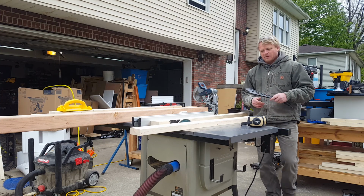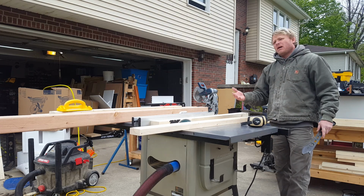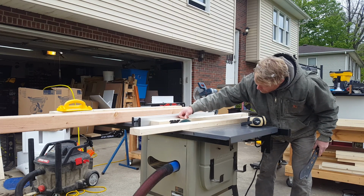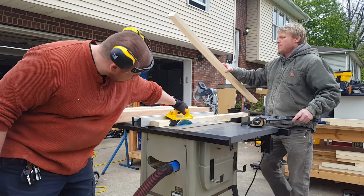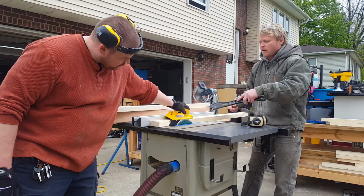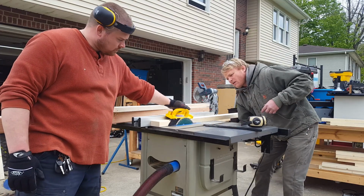One other thing, I'll talk about the blade since we're here. I ride about an eighth of an inch above my material or so, enough that my teeth are clearing it. So there's a little bit in there. I ride maybe an eighth of an inch high. Just enough that it comes through the wood and clears it, but not so high that, if we run that way up,